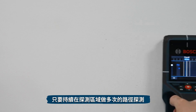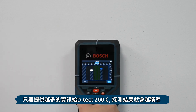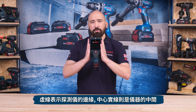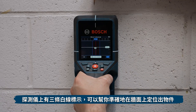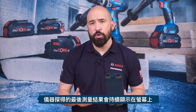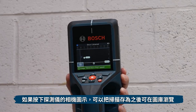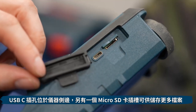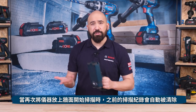If you continue to make multiple passes over the area showing ghosting, most of these signals will disappear. The more information you provide the DTEK-200C, the more accurate the results. On screen, two dotted lines represent the outer edges of the tool and a solid center line represents the middle. Three white marks on the housing allow you to accurately mark object locations on surfaces. If you lift the tool away from the wall, the last measuring result remains on the display. Pressing the camera icon saves the entire scan as an image file, viewable in the DTEK's gallery or downloadable to a computer via the USB-C port on the side of the tool, along with a microSD card slot for additional storage. When you place the tool back on the wall and start scanning, the previous scan is automatically cleared.